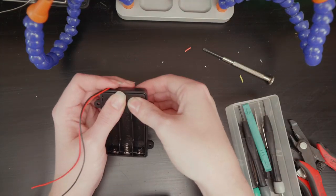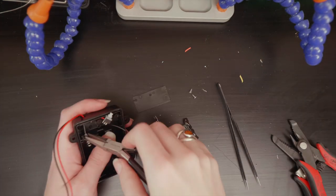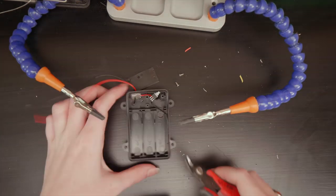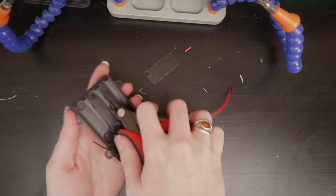I'm actually using the waterproof alkaline battery holder from the bike project as a project enclosure. It already has a waterproof switch and it's the right size for a Bluefruit Feather microcontroller and a flat lithium battery. So I removed the metal bits and cut away small sections of the plastic to maximize the interior volume.